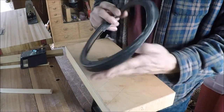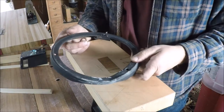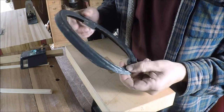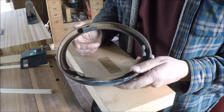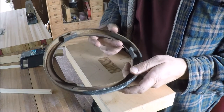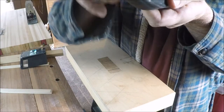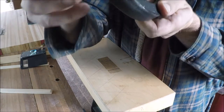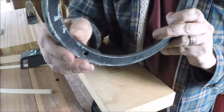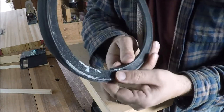The first thing you should know about trying to straighten bent sheet metal like this is it's probably best to try to bend it back in — kind of reverse engineer the bend. I'm pretty sure this is the point of impact right here; it's kinked right there. Hopefully it hasn't stretched the metal too much, though that would make it more complicated to fix.